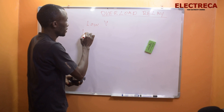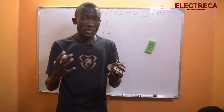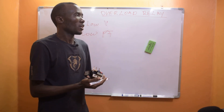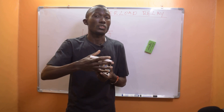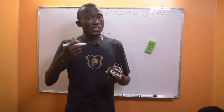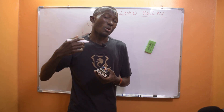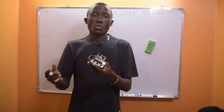Another cause is low power factor. Improving power factor is very important, especially when running these machines. If the power factor is low, you'll have very high current. If the voltage is low, the voltage drop is super high. The motor keeps striving to run, which affects its operation — it overheats and trips the overload relay.